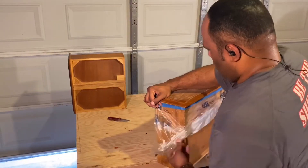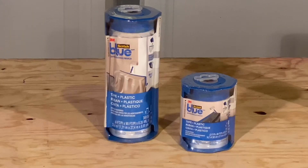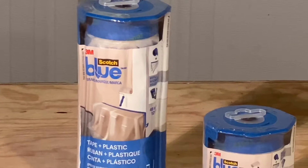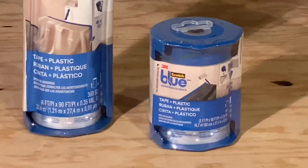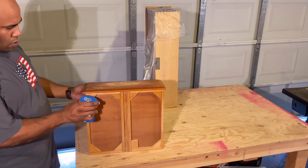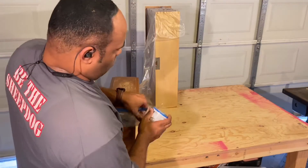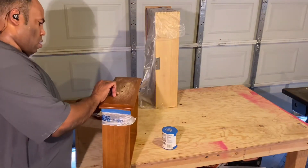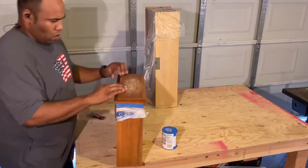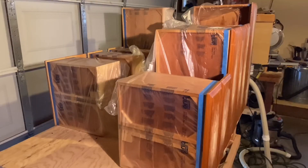For this project I'm doing a combination of stain and paint, and that requires a little extra prep work. Normally I would use painter's tape and a roll of masking paper, but at the home store I came across this tape and paint combo from 3M. It comes in a two-foot and four-foot roll — I decided to try both, using the two-foot roll for the drawers. The edge of the tape rolls right onto the dresser and the adhesive is strong. It's about six inches long when you roll it out, and after you attach it to the perimeter of the drawer, a gentle tug expands the plastic to cover the entire drawer. I repeated that for all the drawers and was done in just a few minutes. Using 3M's tape and plastic combo was a huge time saver — it really cut down on my prep time.